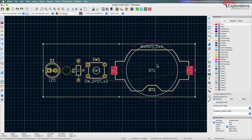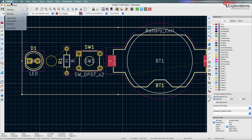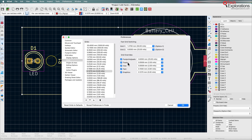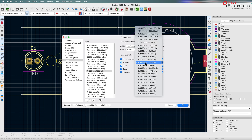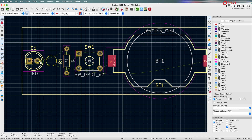Let's continue with the routing. I'm going to start from left to right. In the next step I'm planning to refine the outline and make it a bit more streamlined, so I'm going to try to place all my traces as close as possible to the components and not get them going through the edge areas. Also, in my grids I have a special override for tracks — I'm using a very small track size, which is a bit overkill, so I'm going to increase it to 0.2540.